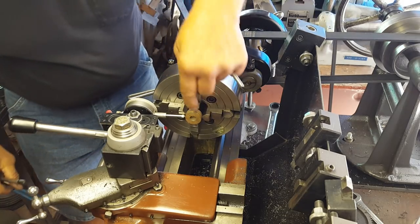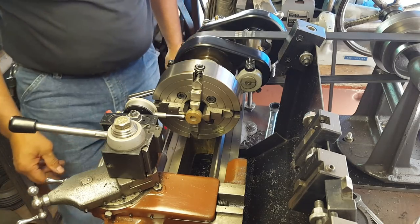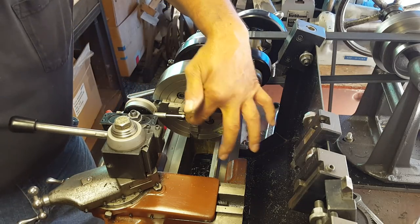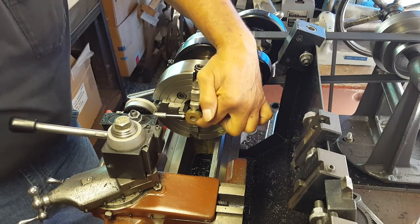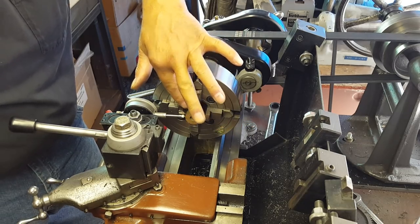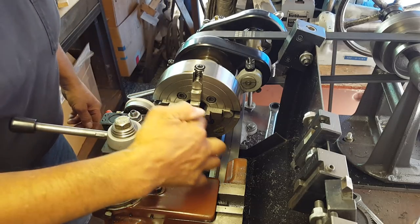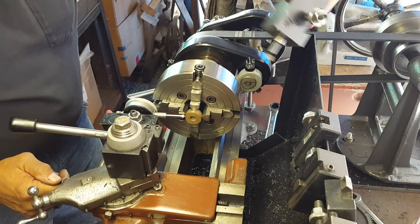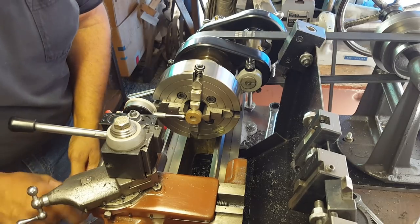Being a small piece like that I can't really crank on it too much because it's gonna distort it obviously. As far as I'm concerned, this is now ready. I put the side in that was bare - there's the bare end right here, this is the side that I parted so it's a little cleaner to say the least. Now I'm gonna go ahead and clean up that face right there and get my boring bar - which is right here - if it'll fit in there. It might not even fit, so I might have to change it.